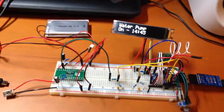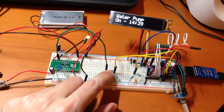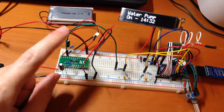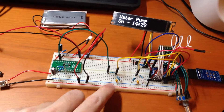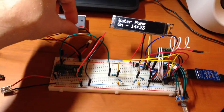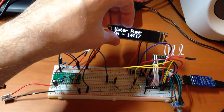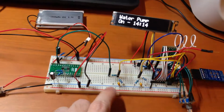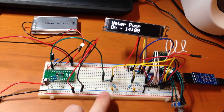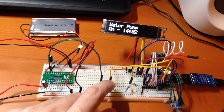I think I might be done with all the circuitry. I still need to get the 10 megaohm resistors, and I do need to revisit the battery draw measurements because I discovered a fatal flaw — I was measuring on the wrong line and should have been measuring directly from the battery itself. I was actually bypassing all the draw that the display is using, which is why my draw seemed so much better than before. So it's not nearly as low as I was claiming last time. I have to wait for the 10 megaohm resistors to come in before I can properly revisit that.